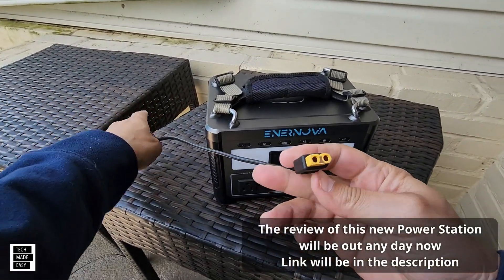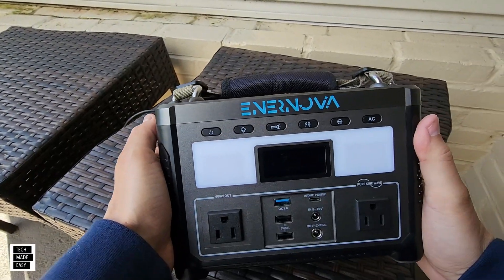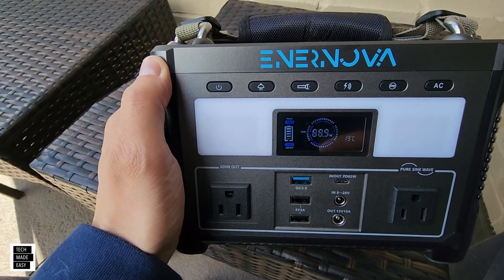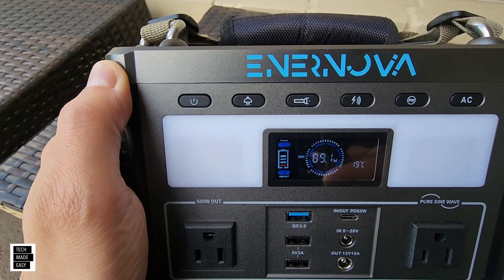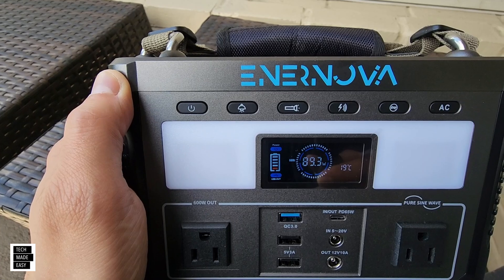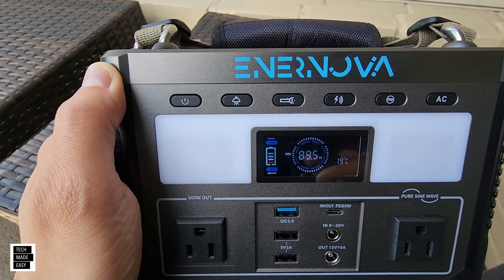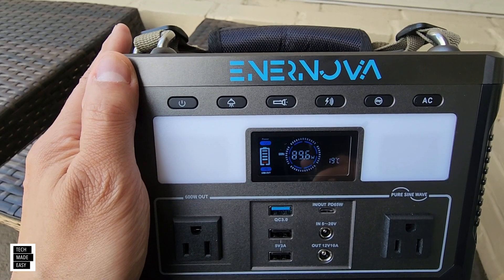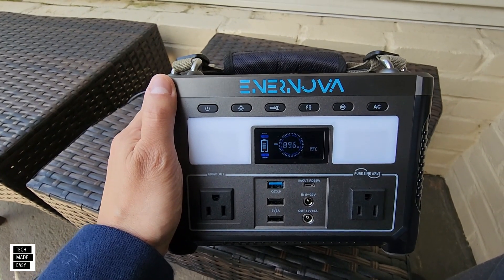Let's go ahead and plug in the XT60 — that's really the best way to charge. You can also use a barrel port. Let's see what we're getting. It turns itself on. We are receiving 88... 89 watts — wow, that's pretty solid. Great angle, 100-watt panel, and we're receiving 89.3 watts. We only have one bar to charge, but 89.5... 89.6 watts now. Temperature out here today is about 51 degrees, partially cloudy. 89.6 watts out of a 100-watt panel — that's a success.